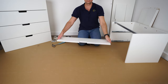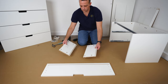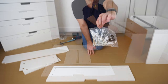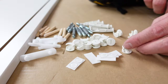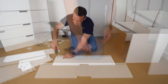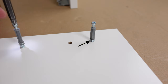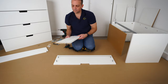Now I'm gonna show you how to do the drawers. This is the front panel — where is the cut? That's basically like a door handle; instead we have the cut on top. Two side panels, one back panel, one bottom panel. Back B — open it up, organize the stuff inside, you'll have an easier time assembling. Use those four screws first — two on each side. Watch which hole they're going into, just copy exactly what I'm doing, and go just till the stopper. Not deeper, not higher.